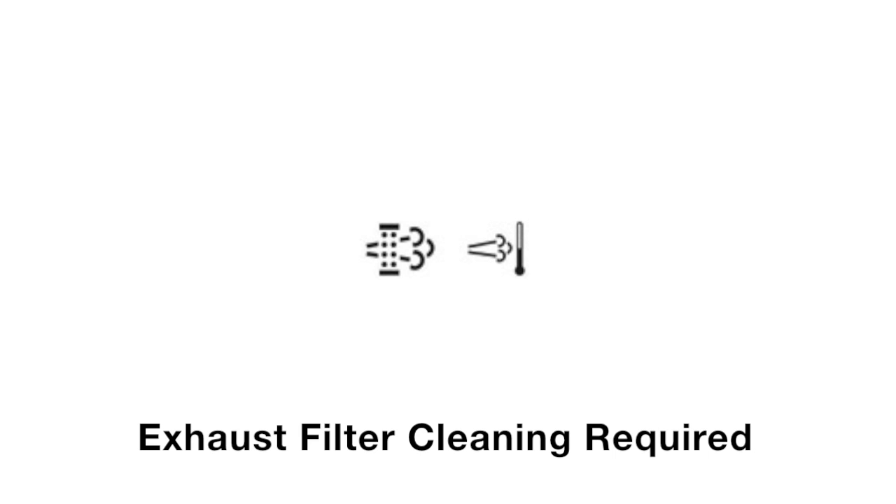Note: when you see these symbols, if the high exhaust temperature — up to 1100 degrees Fahrenheit — and your operating environment at the same time is a concern, you should disable the process by pushing the disable button. However, I do not recommend continually disabling the regen process or leaving the tractor in regen disabled mode. Disabling the regen process numerous times or leaving it in regen disabled mode will lead to the engine horsepower being derated, and either a parked regen being necessary or ultimately a service regen process, which is not covered by warranty.